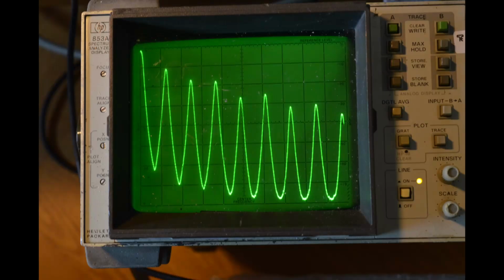Just for fun, I thought I'd have a look at the signal on my old HP spectrum analyzer. This is at 120 kilohertz. Fundamental is the large peak right at the left at 54 decibels millivolt. So you can see the fundamental, and it's 100 kilohertz per division and 10 decibels per division vertically. So you can see that the fundamental is at about 120 kilohertz and about 44 decibels millivolt, which is about 128 millivolts, I think. And the second and third harmonics are about 6 decibels down.